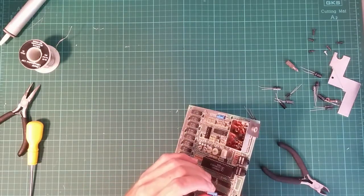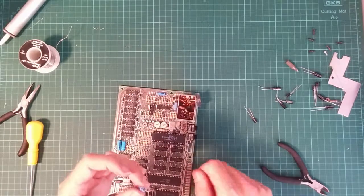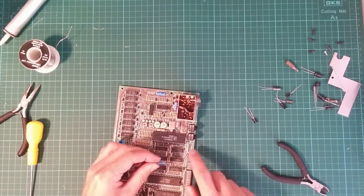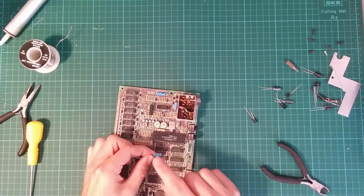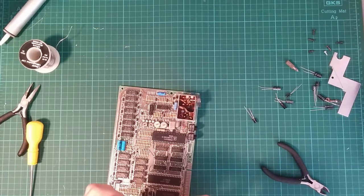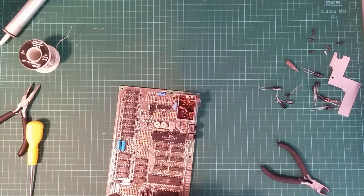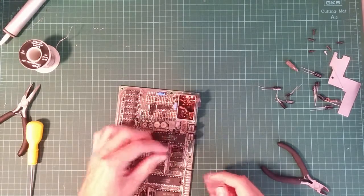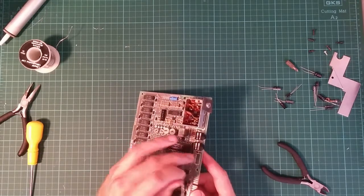Check. Oh, that's interesting. No, right, sorry. I was misreading the labelling. I thought the negative pole was connected to the positive thing on the board, but I don't know if you can tell. These axial capacitors, the negative is an arrow rather than a stripe, which it is on the radial ones. Good, this is another 22. I'd be better off doing it like this. I probably would, but I'm not particularly happy with having long bits of metal and these pads on the board, so